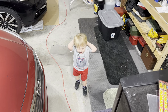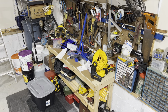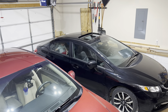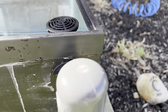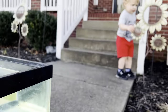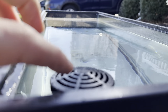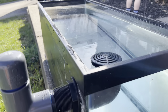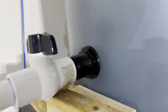He's throwing a tantrum because I took the tank away — how dare I. You can kind of tell I'm doing some plumbing work on my workbench. This is called parenting — just let him stay in the car and play around. I'm doing a water test: I filled it all the way to the top and it appears the bulkhead is holding with no water coming out. I'll probably angle the standpipe down a little, maybe 60 degrees from vertical. Everything looks good. I'm glad I did the test first — I'll let it sit for a while since I'm in no rush, and water test two is looking good.